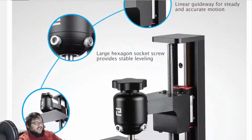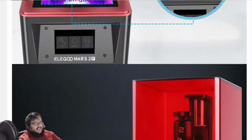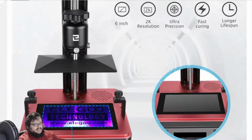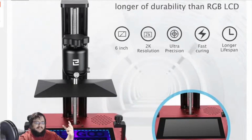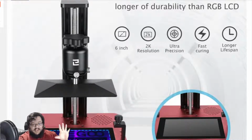So one of the ideas we had when it comes to making a mold that we pour resin into is that when you make a mold of anything, especially a 3D printed mold, the resin or silicone or whatever you pour into that mold is going to show the shape of everything in the mold. And that includes all the layer lines. If you print it in anything FDM, layer lines are going to be all over your mold in every single mold.